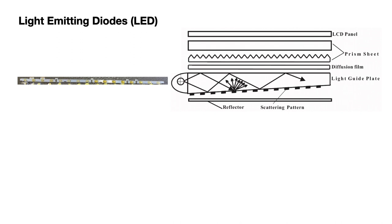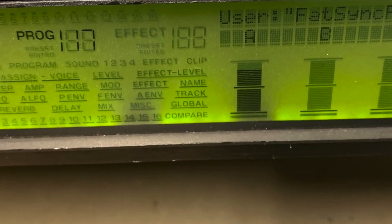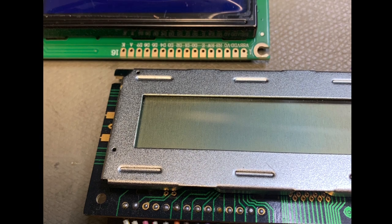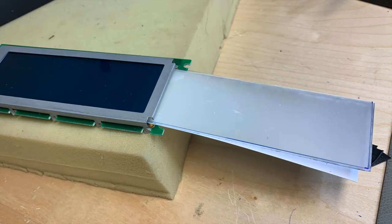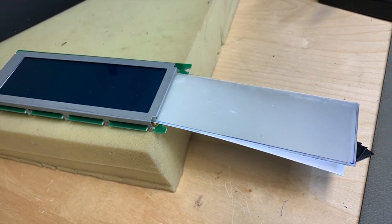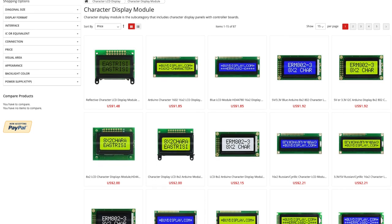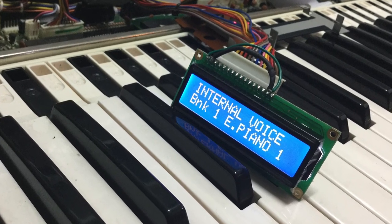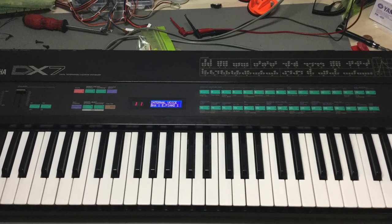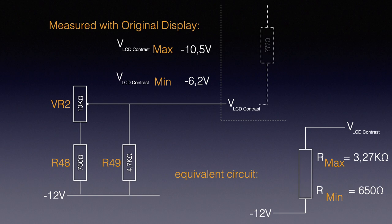Then the best one: light emitting diodes, LED. This is the prevailing and recommended backlight technology. Most new LCD displays use LED backlighting, but these also fail — although after many more hours than the previously mentioned technologies. You can either replace the complete LCD display with a standard built-in LED backlit display, or replace just the LED lighting, or go the really difficult way and make your own backlight assembly if new displays or assemblies are not available at normal prices. Most displays used are commercial off-the-shelf displays which can still be bought — you can still get an off-the-shelf LCD display that is a drop-in replacement for the DX7, almost 40 years that these displays are produced. The tricky bit is always the contrast voltage, which differs between old and new displays — this is where most display replacement projects go wrong.